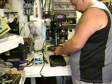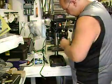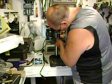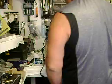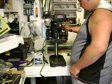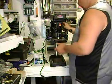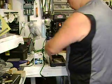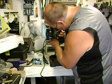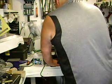So, now if you want to see how good your alignment is, you can probably take a pretty good guess, but now I'm out by just a couple of a degree. So I can loosen this off. Now your table is always going to have some outage to it, but the important thing I'm going after here is to try and get the head to look as if it's parallel as possible over top of the table, so the table and everything sits as parallel as it can get.